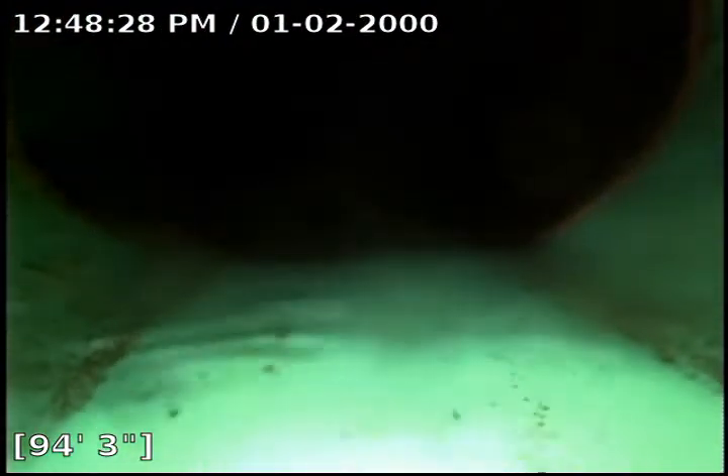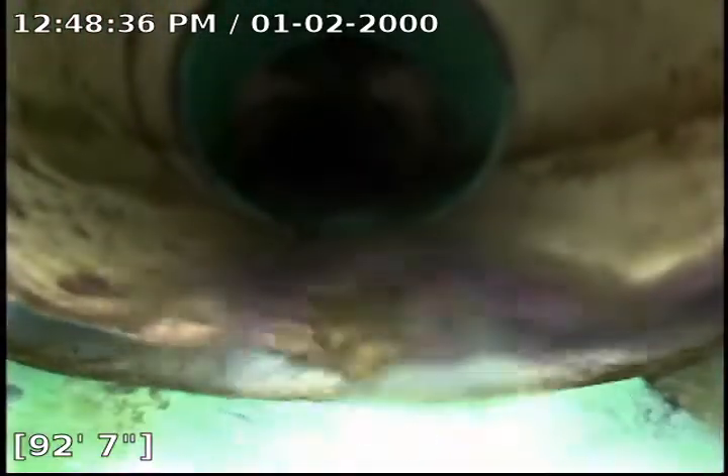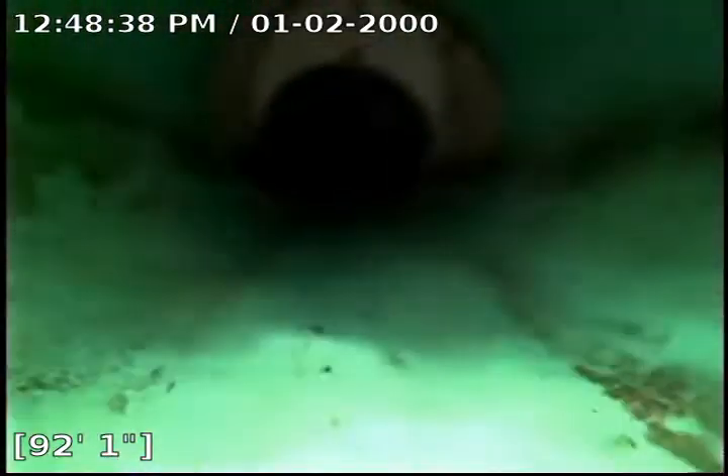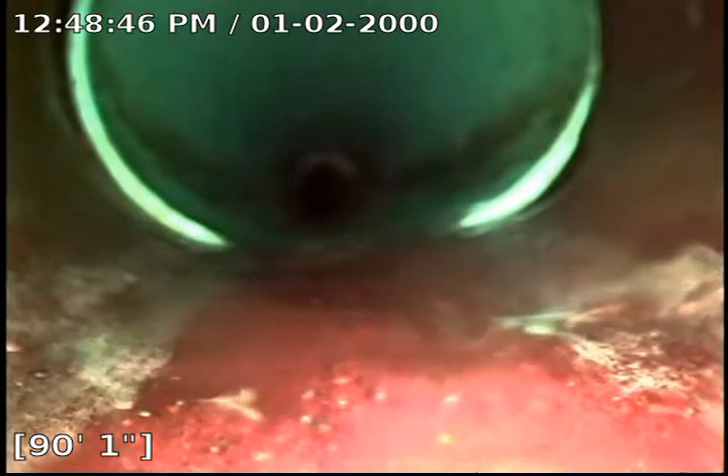There is a little bit of running water, just trying to help get the camera down there. Initially we were in a clay line. There's a repair right here — this is some SDR and some PVC joints, which is actually probably just SDR in general. And that ends right about here when we transition back into our clay line.